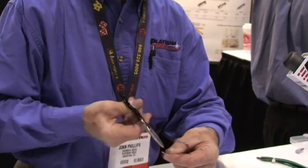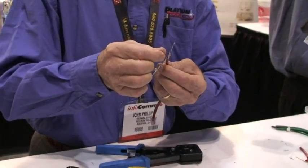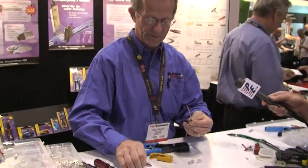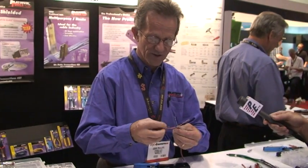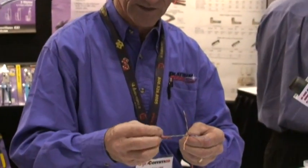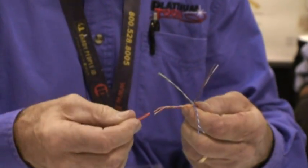You just go ahead and trim this little membrane for strength. Then I like to bring my cables out and take the cable jacket that you removed — this is your pair separator. As I come off, I sort of squeeze and comb out the kinks, because you want to be able to lay the conductors side by side with no gaps.